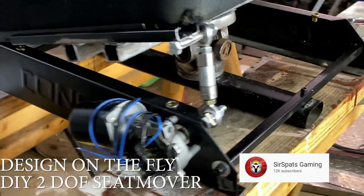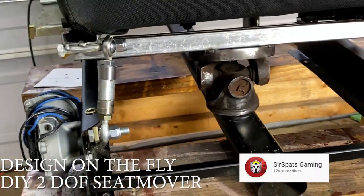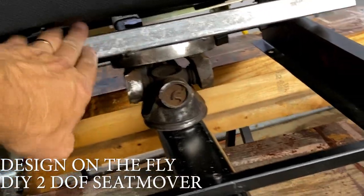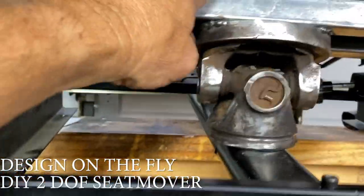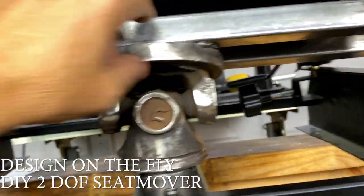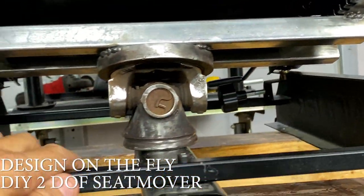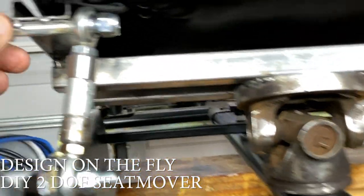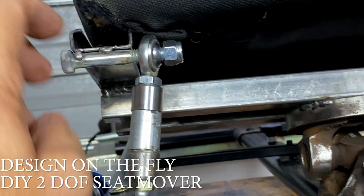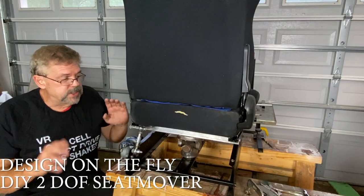Dennis from Sursfats Gaming Channel Discord brought up a good point: what if you don't have a welder? How are you gonna do this? All these different pieces you could actually just drill them — I could have drilled holes through here and bolted them on. I could have done the same thing here and right here. I primarily use the welder because it's a lot quicker. It got a little bit toasty here but that just temporarily holds it in place.